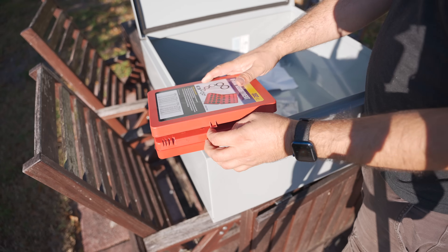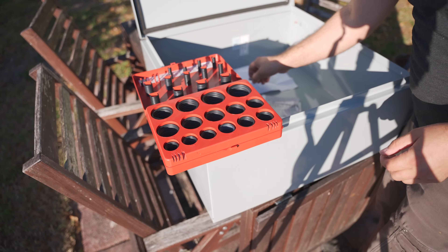One very important thing to note: for any seals in the tank, the pump, or anywhere — wherever you would normally use rubber, use Viton or Nitrile. I picked up this Nitrile O-ring kit for $10 at Harbor Freight to seal up all the ports.